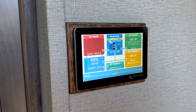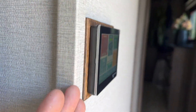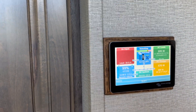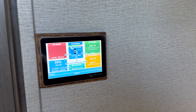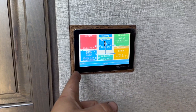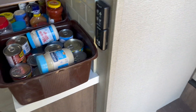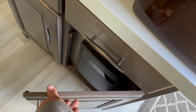Inside, this is what we ended up doing. We did this on the last Grand Design Solitude too — because of this pocket door, we needed to step the screen out a little bit. This oak picture-frame thing I made doesn't match the finish perfectly, but I think it looks pretty nice. You just have to drill one hole right through here, and using the endoscope we were able to fish a line all the way down to that compartment below. Then the main power panel — you just connect the output of the Multi-Plus into that and everything works.